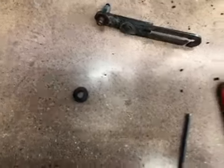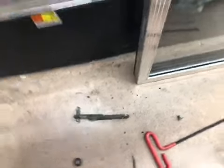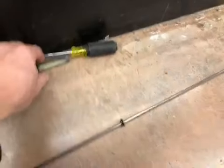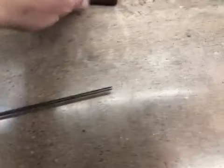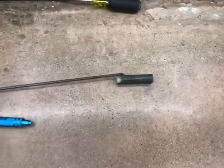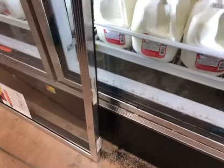The second thing: if the door won't close, you can have the bottom portion of the torque rod cracked. There's a plastic piece — here's the torque rod right here. The torque rod never really goes bad, but you've got these plastic pieces that fit on the end. I have this one taken off, so we're going to start repairing this torque rod and I'll come back to you in just a minute.